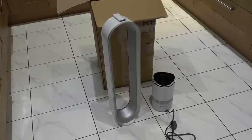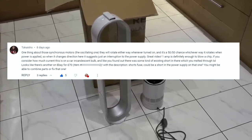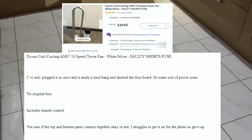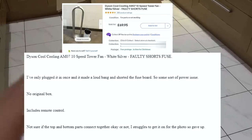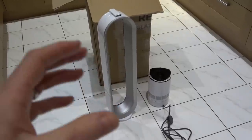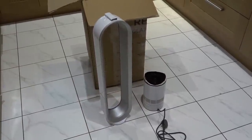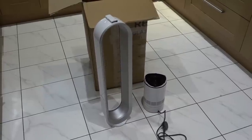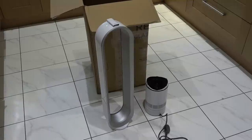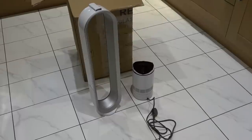A very kind viewer mentioned there was another one for sale on eBay. Basically what the listing said is that when they plugged it in there was a loud bang and the fuse board trips. What I'm hoping — I could be wrong — is that maybe the fault is early on in the power supply, not at the MCU which is like the brains of the operation. So for example if it's a fault with the bridge rectifier or one of the big filter caps, maybe I can combine the two to get one that's working.